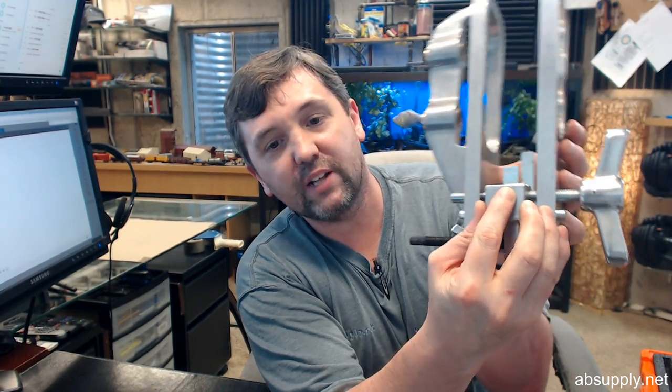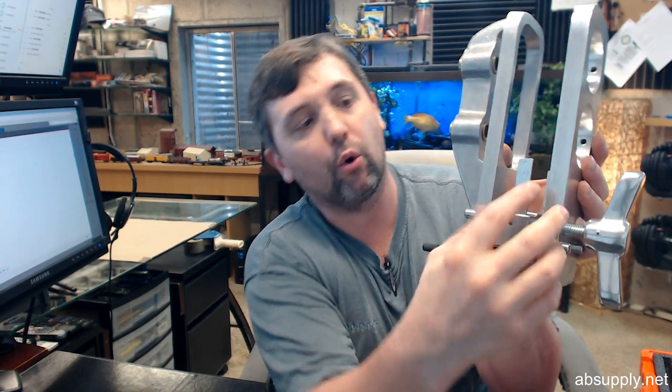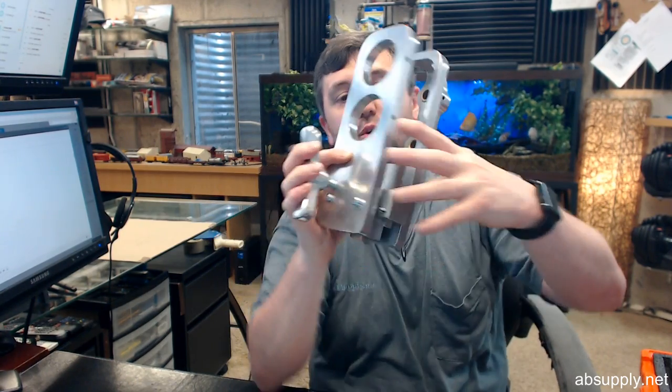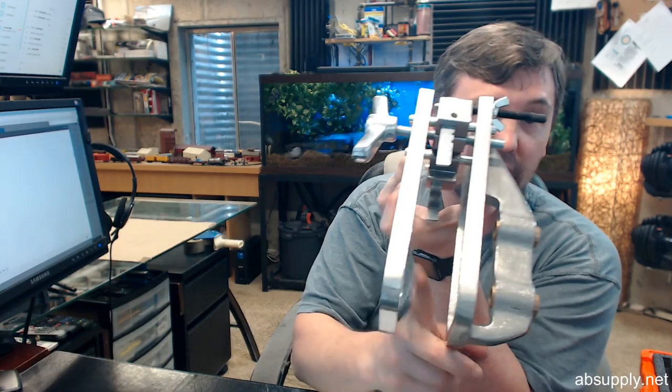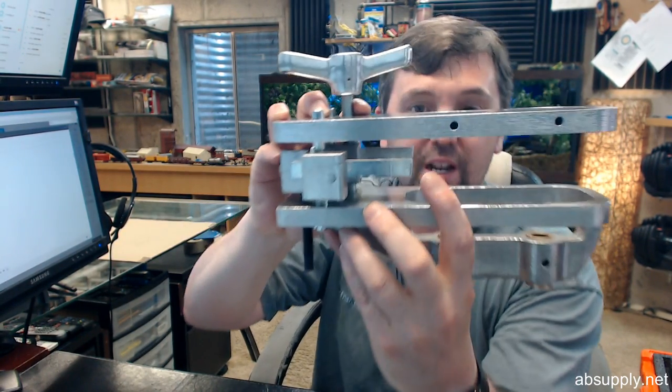That'll go 2 3/8 or 5-inch. We'll talk about how that works. Or the last one, 3 3/4, and obviously set it on both sides. The concept there is that when you put this onto the door, you've got your 2 feeler gauges here and here that you're going to bump up to the edge of the door. Take special note that it's beveled.